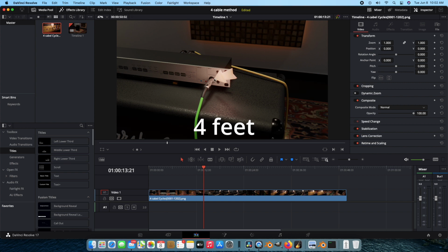Because the longer the cable, the higher the impedance, the more degraded your signal is. That's why they have buffers for guitarists that use pedal boards. You buffer the signal usually on the output if you're driving a long cable to restore that impedance. So when it hits the amp, you're not losing any of your frequencies, or you lose less. And correct me if I'm wrong on that. That's just how I've come to understand it. I'm no expert on using pedals.